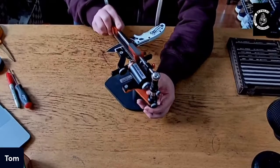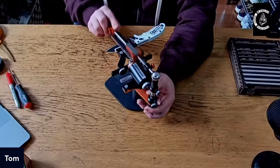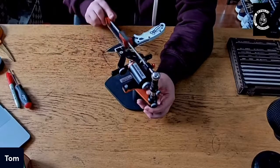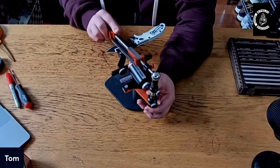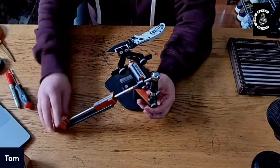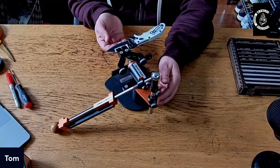And just do scrubbing strokes on the heel. So our heel is looking really nice. It's nice and square. I got it pushed up as tight as I can with the tape being there. So this edge looks nice. We're going to feel the bottom with our fingernails. We have a burr. So we have sharpened to a burr already.